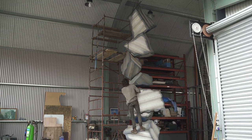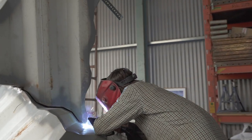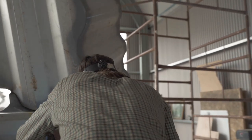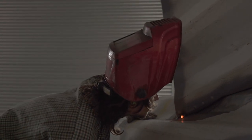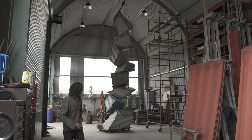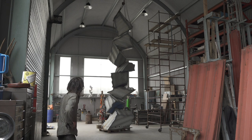After the piece was fully welded, it was necessary to get rid of all the weird colours, so I took it for shot blasting. That's the only thing which was done off-site and not by me. The shot blasting has the effect of removing all of the paint and keying up the metal so that it rusts fairly uniformly and fairly quickly, which is essential.